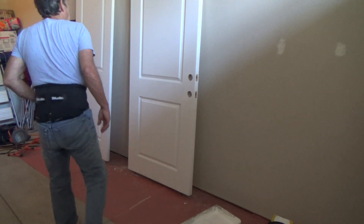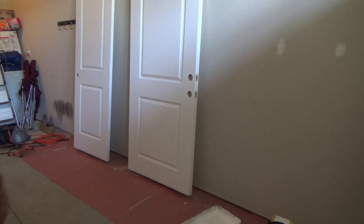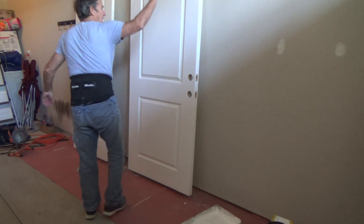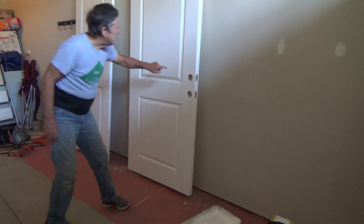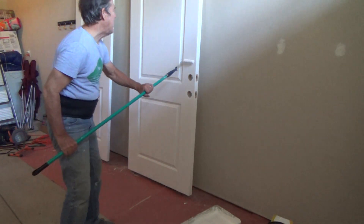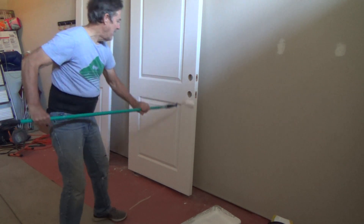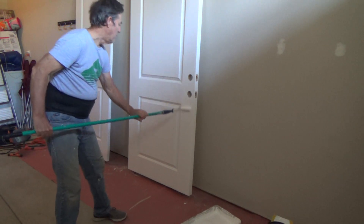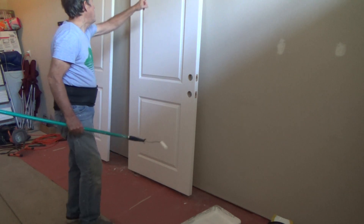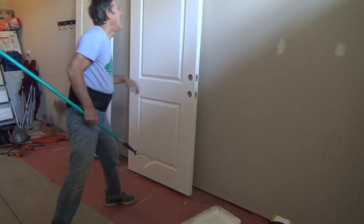If you're only doing one coat, let it dry and reinstall your doors. But because this is my garage door going into the condo from the garage, I'm going to let it dry and put on a second coat. I've already got two coats on the back side. I can see what looks like an extra line — I could sand it out on the next coat. But if you're not doing another coat, you can fix it by going top to bottom again. Don't just try to fix one little edge in the middle of the door.